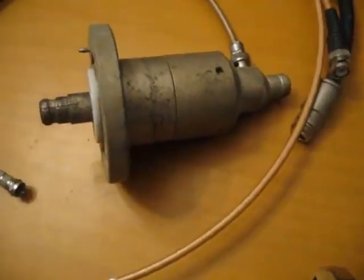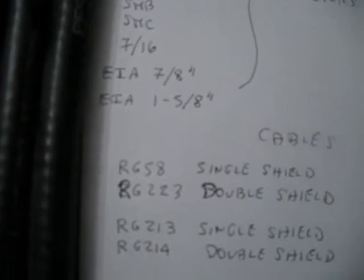So it's always good practice to connect a wire or a screw through those connectors. Don't let any static or other potential go through you. Don't put your right hand on one and your left hand on the other. You could get a jolt. So always try to short the outsides, that is the ground shields, together before you mate them.